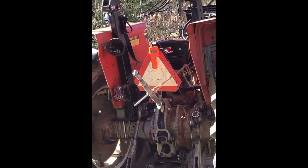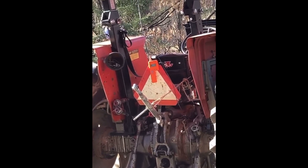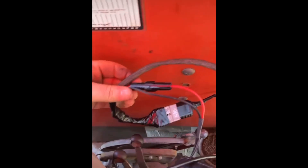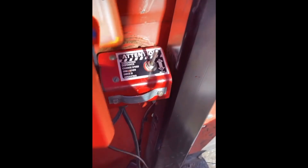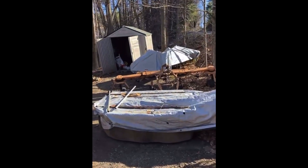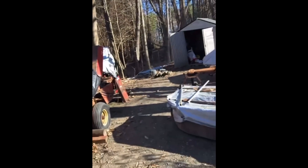I just put the hay back, taking the hay away again — nothing. What I did is tee off from the bale thrower controller that already gets electrical from the tractor, and so I teed off for the moisture sensor. It can either hang here but that's not super visible. What I think I'm going to do is mount it somewhere up there — and obviously instead of the baler being over there it's going to be behind us — so I can just turn and get a moisture readout right as we bale.